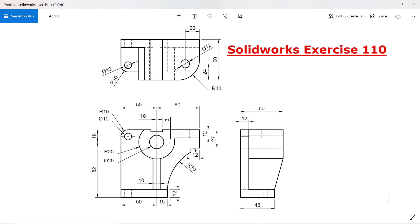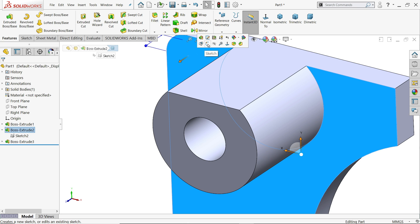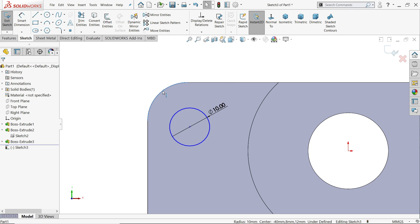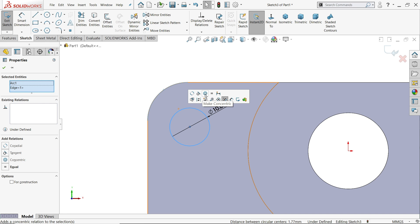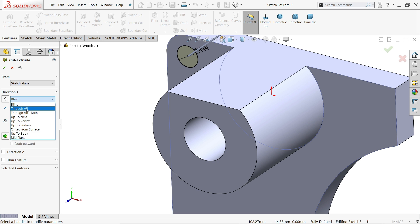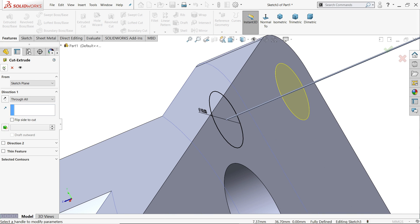Now there is one cutout — 12mm length. On the upper side there is one flange 12mm with corner radius 30mm. There is one circle 12mm, 24 by 20. There are also radius 10mm corners here. I'll sketch and select a circle, draw one circle at 10mm, then hold shift key, select both circles, and make the relation concentric — it's fully defined. Go to feature, choose extruded cut, and keep end condition through all. It will cut up to the end wall.